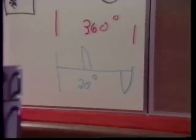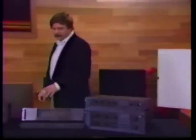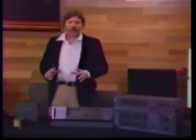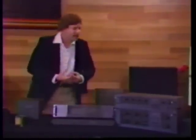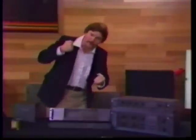The device that controls this small time interval is this electronic switch, which is called a triac. Now that's the fundamental operating concept, that the energy is stored in a magnetic field and is available on a moment's notice so that the power can be delivered instantly to the loudspeaker.